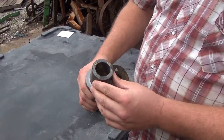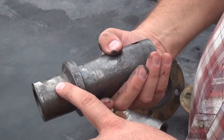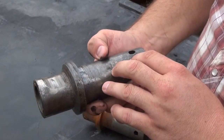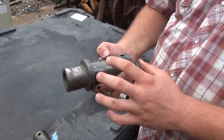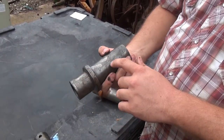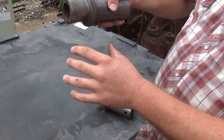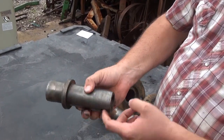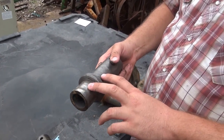However, if you find a bearing that looks like this — and it may look round at first — somebody clearly did not grease this axle for quite some time. This material is chilled gray iron, which is so brittle I could break it by dropping it from waist height onto hard concrete, but because it's so hard it wears really well, so it took a lot of use to wear this bearing down. Now, with it worn like this, you can likely rotate the bearing 180 degrees — notice the holes are 180 degrees opposite — and probably make it work.